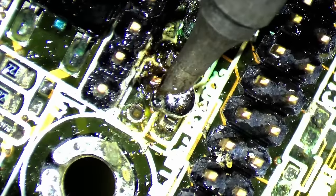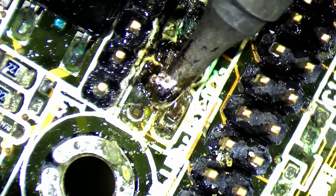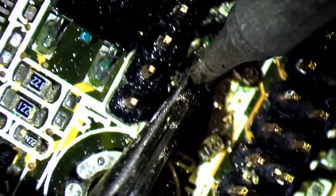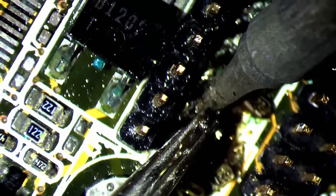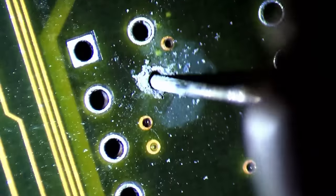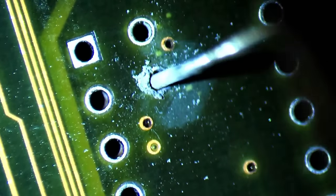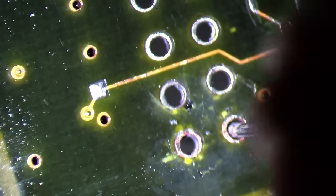Let's focus now on the bottom right corner where the connectors for the front panel are. Extracting the old pin headers took quite a bit of time and patience. And some of the metal pins broke in half, probably due to fatigue from the corrosion. It really wasn't easy to get them and the solidified solder out of the holes, but I did succeed after a while. My vacuum desoldering station came with a tool to clean the nozzle. It is the perfect tool to clean the holes from any residue those pin headers left behind.